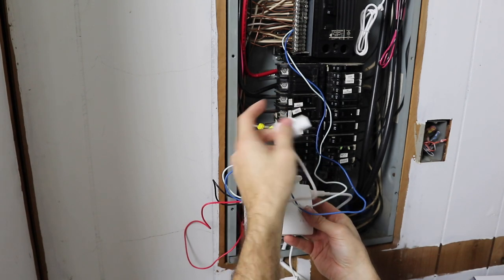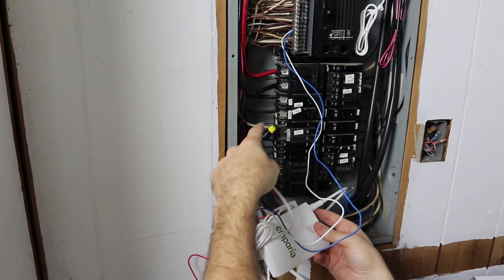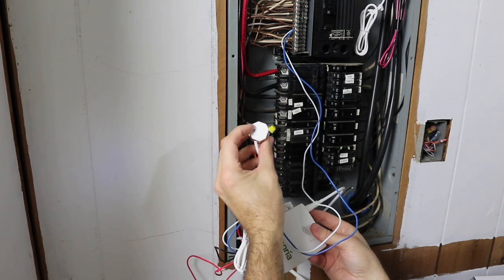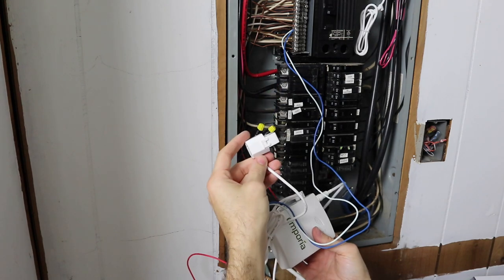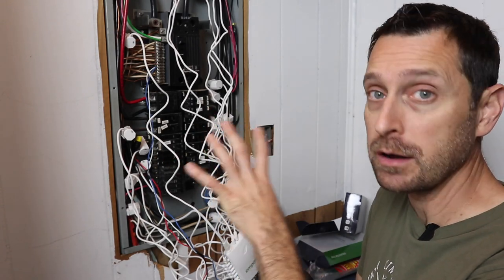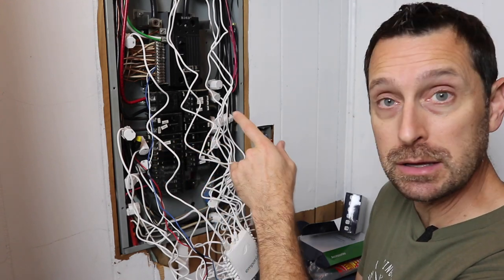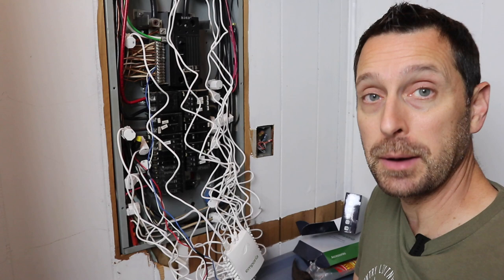Now it's time to connect all of our sensors to all the hot wires. Remember, on double-pole breakers you only need to connect one sensor. Depending on how full your box is and how wires are routed, you may need to connect sensors away from the breakers in a different spot — just remember the arrow points toward the breaker. Use your zip ties and button everything up nicely. We have everything connected and you can see there are sensors everywhere. In a tight panel like mine, it's quite a challenge — there are a few at the top, one around the side, and some on the other side.